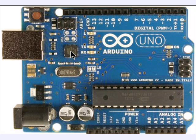Again, your connections are brought out here to the edge. Here's digital pins 0 through 13. Down here again is A0 through A5. That's your analog channels, and of course, this also puts out 3.3. Some parts today use 3.3 volts. I generally don't use them.